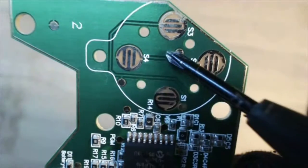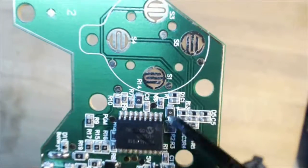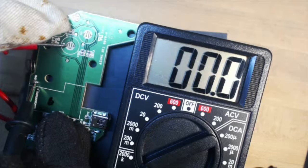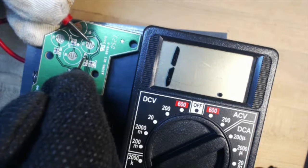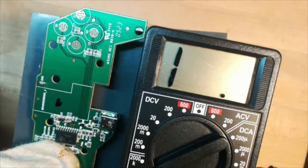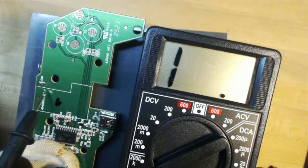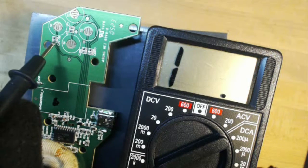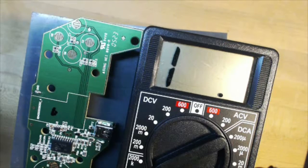It's the same for the other side, but we see a lot of other components, including an IC. I think this part is too complicated to hack. But because we have test pads, we can still grab a signal from each button. We get a complete circuit from ground to the entry half of the button pad, but no signal from ground to the other side of the button pad. And we get a good signal from the button pad to the test pad. So in theory, we could solder wires from the ground to each of the test pads and read the signals whenever the elastomeric pad bridges the two sides of a button pad. If we also cut the traces before the signal gets to that cluster of other components, then we can probably get eight reliable on-off digital signals. That's simple enough to do — it gives us eight digital inputs, and most small microcontrollers can handle that. We might be able to reuse this board.